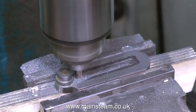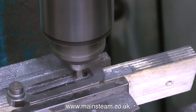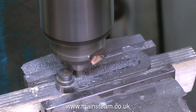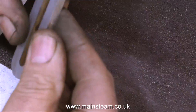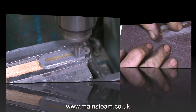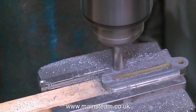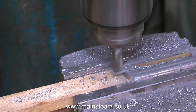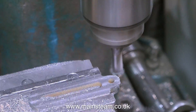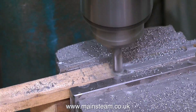I'm using a piece of quarter-inch brass rod to gauge the width of the slot I'm cutting. When the piece of brass rod goes into the slot, that's it — enough milling, I have a quarter-inch slot. I rub the part on emery cloth to remove the burrs, then it goes back in the machine vise, where I'm milling this component to the final finished size. The drawing says it has to be 5/32 of an inch thick, which I think is probably a little bit thin, but I think it's best to follow the drawing.